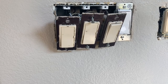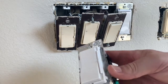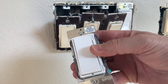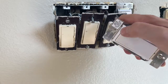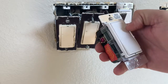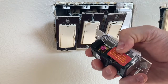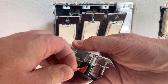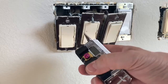Making my way down the bank of switches — these are all dimmers. This is a three-way dimming switch; here's the dimming feature right here on the side. Same as these, just a different color. It's just a straight wire-for-wire swap, making sure you put the right wires in the right spots. You might see this label here — this is for a three-way switch, so I'm going to be removing that. If you were using just a regular switch with the dimmer you could keep the label on.